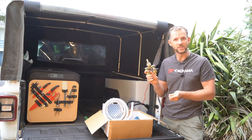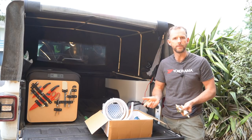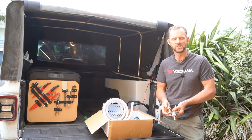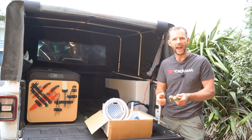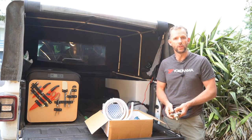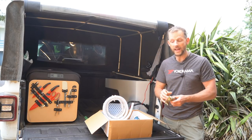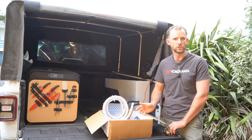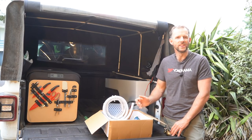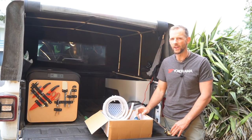This is a bit of a Frankenstein of parts. Here in Australia, this project falls halfway between real plumbing, garden hoses, and sprinkler setups, and it's not exactly clear how to connect everything. I'm being really careful to make sure everything is food grade. Food-safe hose is easy to come by and as long as I use brass fittings I'm okay — I just have to avoid standard gardening hose, which who knows what that's rated for. It's been a challenge getting all the bits and pieces, but I think I've got everything I need.